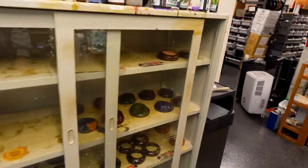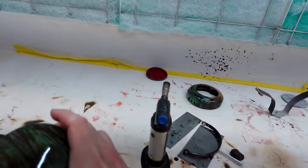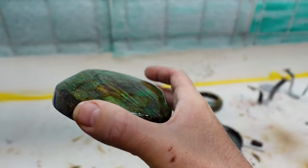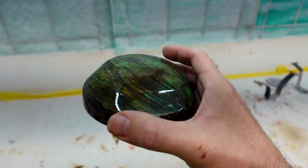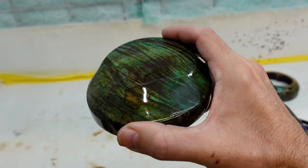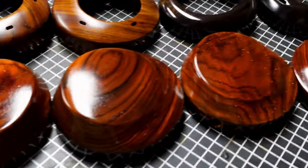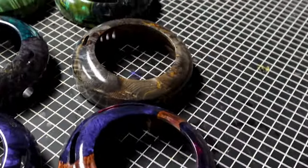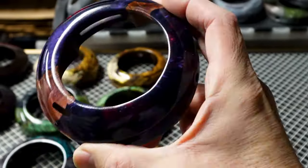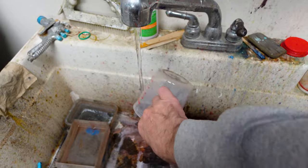We also use true oil. Here's a green set just for contrast — the other one has true oil on it. It's shiny, kind of a gloss varnish. I think of it as a violin varnish of sorts — more gloss and kind of chatoyance that it brings out. We also have sprayed finishes, which is what these Cocobolo sets always get. That's a lacquer — you get that classic instrument lacquer gloss sheen. We use a conversion varnish to make sure the finish is as durable as possible.